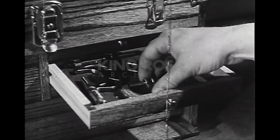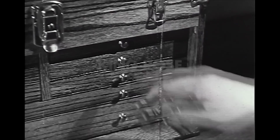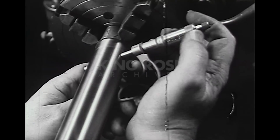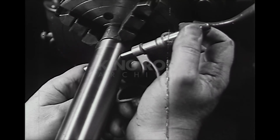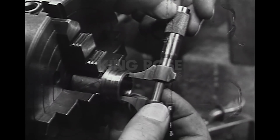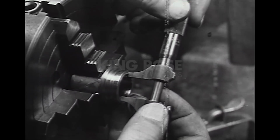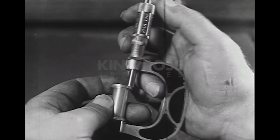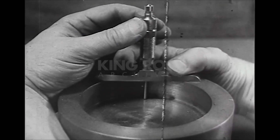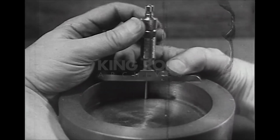The most important measuring tool in machine shop work is the Micrometer Caliper, used to measure variations in size too small for the human eye to see. Different types of micrometers are used to measure inside widths or diameters, outside lengths or thicknesses, and the depth of holes or cuts, but the principle used by each is the same.